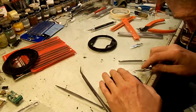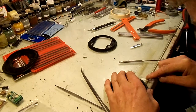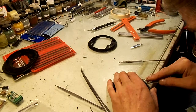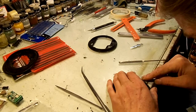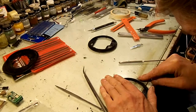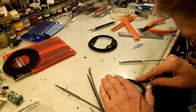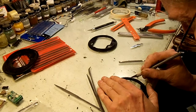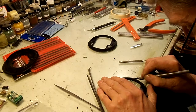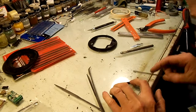This can be really time consuming, so if you want to speed things up you can carve some away with the knife — be very careful. I'm just gently paring that away with the blade. Use whichever method you're more comfortable with. Filing is the safest way — it takes longest but there's less chance of messing up. If you do file, make sure you keep your file flat so you don't get into the teeth on either side.